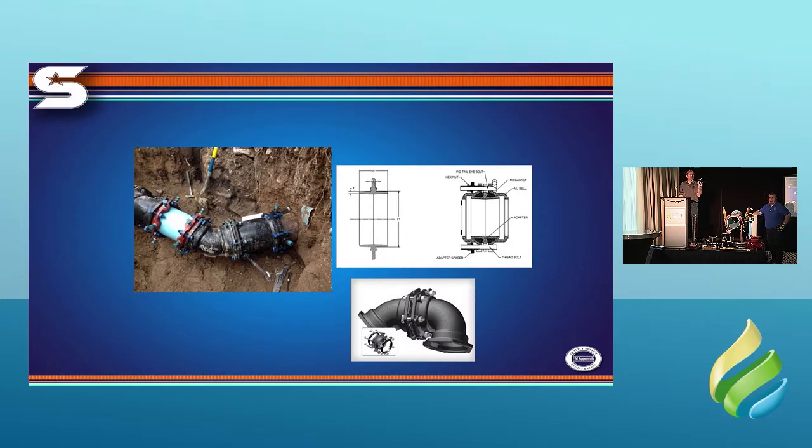So what it does is basically it's two little pipe stubs that you put between, and we're going to show you how you put it together. It allows you to put mechanical joint fitting to mechanical joint fitting, and you get a nice tight turn. So if you have space restraints or you don't want to cut a little spool of pipe, this is a great option. Quick turns or changes on the job site, we'll get calls all the time. It's a solution product. A lot of the times they didn't see something coming, and they had to do a quick turn. And this they can achieve, as you'll see in these connections, which we've already got done. You can definitely get some quick movement around obstacles. And they're available up to 36 inch, so it's not like you can only use these on the smaller diameters. It also works well in valve chambers where you definitely have size constraints.